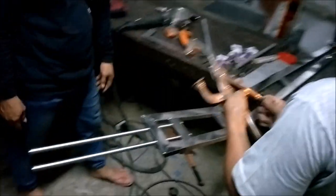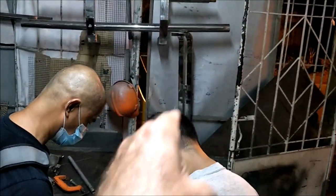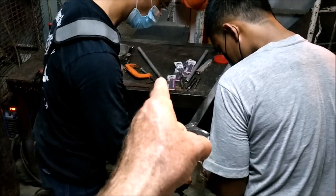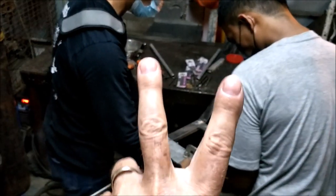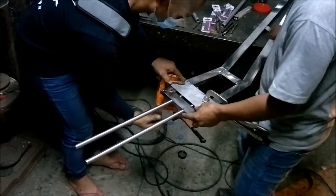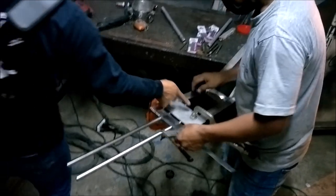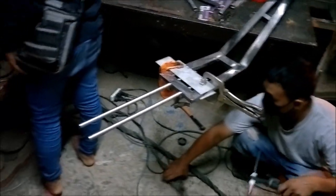What we're doing is welding these little rods that slide down into the tubes, which allow this tarpaulin bracket to be removable. They're trying to get everything perfect and square because these have to be perfectly parallel — the tubes they slide into are a pretty tight tolerance. If they're not perfectly parallel, they won't slide in smoothly. The guys have been working on getting everything lined up, they've got their square to make sure it's perfect.